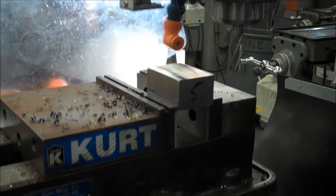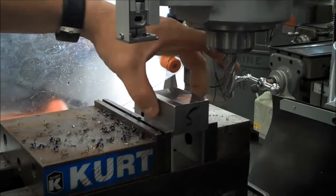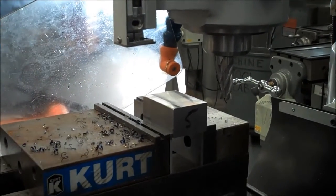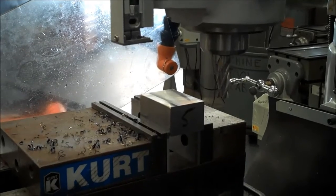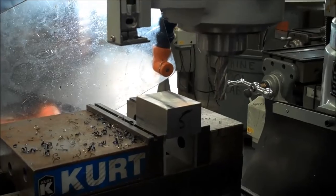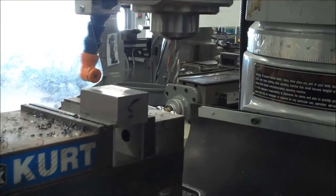Sides 5 and 6 require us to tap them down because now we're using all 3 of these sides, these 2 right here and the bottom, as reference surfaces. So we have to be ensured that they're laying flat against the parallels. So you tap it down on both ends. You'll also notice I've changed the tool. I've gone away from the facing mill because that's going to cut on top, and now I have side 5 hanging off the edge of the vise.